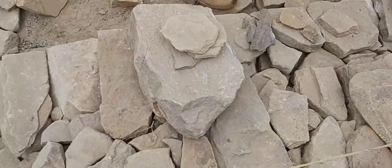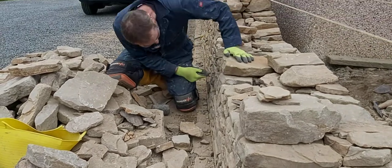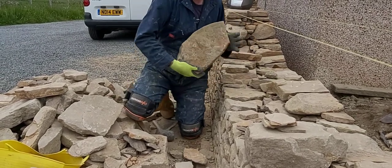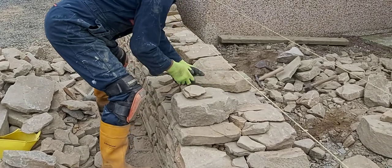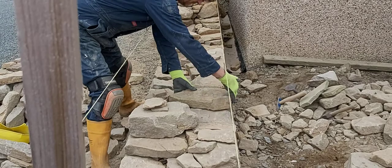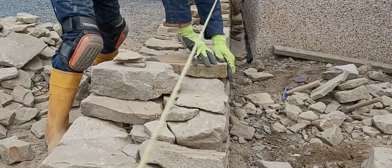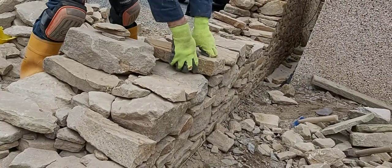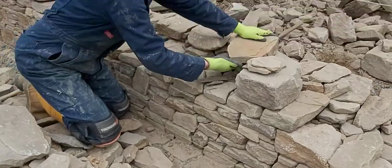Placing it — I've got one stone over two. That's better because there's a kind of natural angle in the face, and I've got one stone going over these two. It's all quite nice. It just needs to be pinned up from inside, so I'll just put the pin stones inside the wall so it won't fall in.